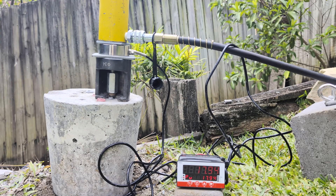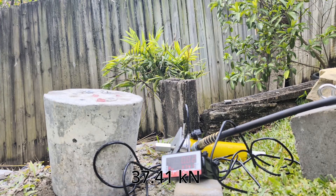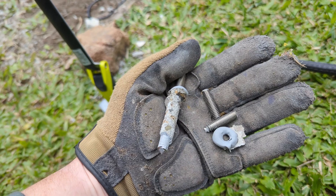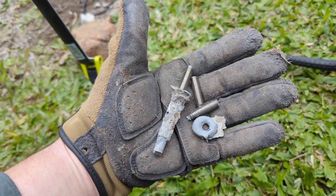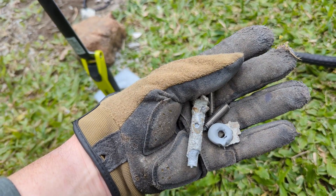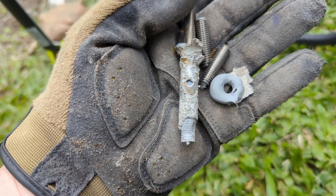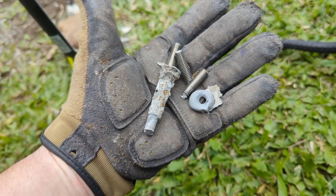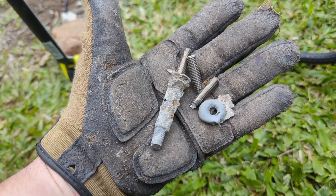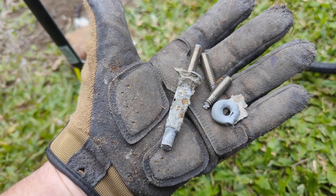Epoxy three: 37.41 — very nice. So fairly classic epoxy behavior right there, steel failure or concrete failure, never glue failure. Even on this one, there was actually a bit of a bubble in there — kind of to be expected, because this stuff did not dispense very cleanly. It was not nice to dispense at all. But still, it's behaving exactly like you'd want in an epoxy.